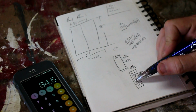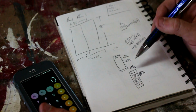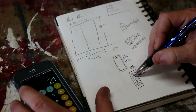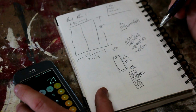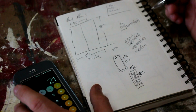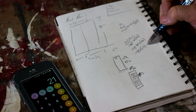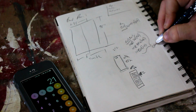Then I've got these pieces going across here. Now 1x3s, as we know, are 2.5 inches. So I'm going to have 26 minus 2.5 times 2, which is 5, is 21. So these are going to be 21 inches across. And I'm going to have 2 of those as well. Cross beams I'm not going to worry about yet because that's an angled cut, so I'm going to use whatever cutoffs I have from all of these to do those. So the front of each door is going to be 2 26-inch 1x6s, 2 84.5-inch 1x3s, and 2 21-inch 1x3s. All of this per door, so 2 doors.